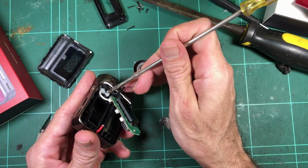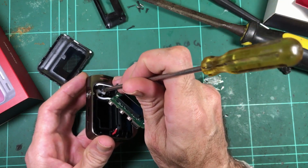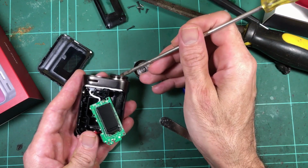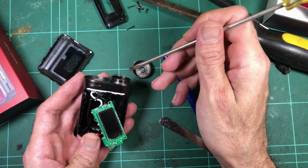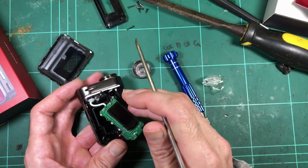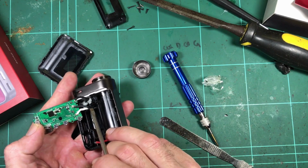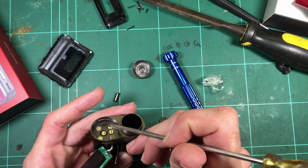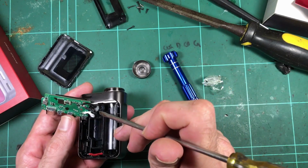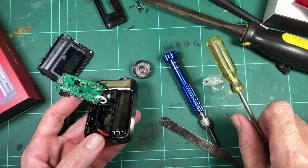So this here is actually your battery negative. This is a solder point to go onto the case. I can check it, but we'll find it has continuity to the case metal, which then has continuity to the cap and through the threads to the negative of the cell. First of all, it says B negative. Second, these are the two output wires, and they go to the pins for the atomizer, which technically wouldn't even need to be insulated or need another wire, because they could have that just connected to ground, and then it could be common through the board.